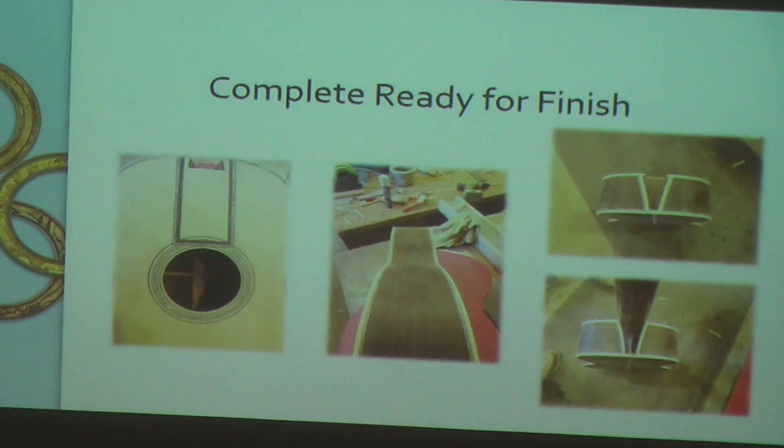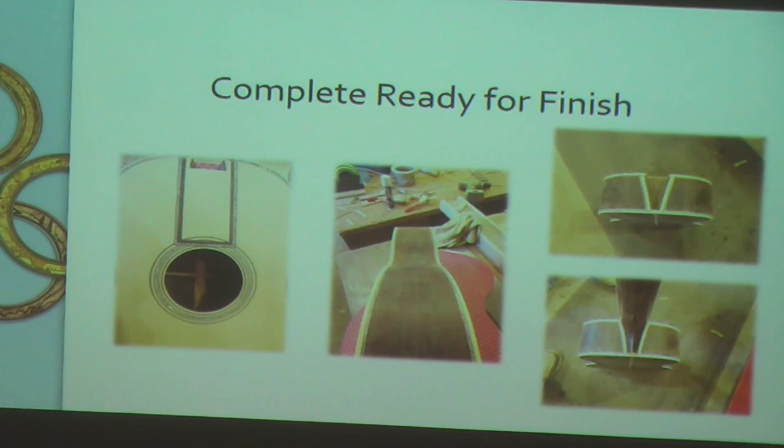So now you can see what it looks like after it's done. It's going to look horrendous on this guitar because it was a conversion. The glue makes it a mess. Now you're going to sand down to it. And let's say that when you sand, you don't have the purfling perfectly flat. Get your sealer coat on there. Now you can back it up with either super glue or finish. That will flush up and it will look nice and shiny when it's all done and rubbed out.